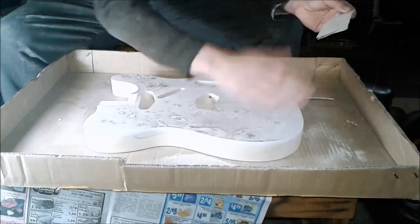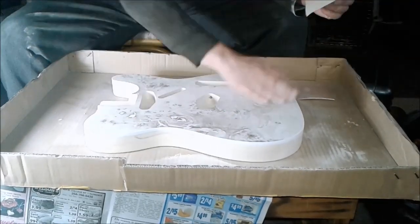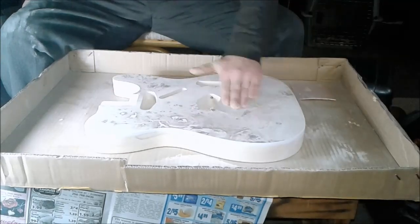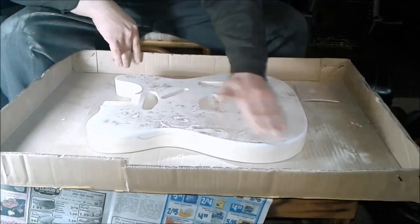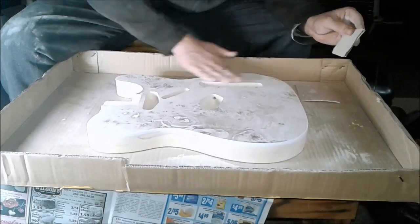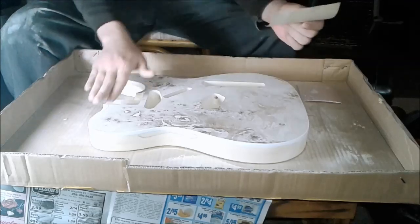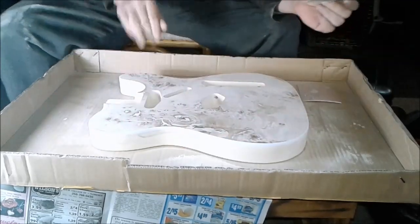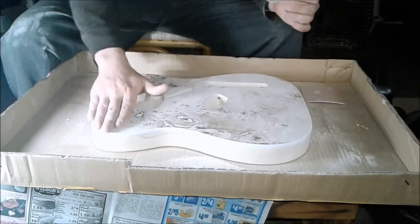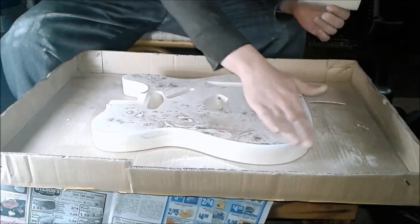Make sure you wipe this plastic filler dust away. It will scratch the top. Now, 120. And I will say I was making an emphasis to go around the edges quite a bit more than I am in the center here. Not only because it's going to be covered up with a faceplate and a thing here. It's because I want to ever so slightly arch this top. If this didn't have binding on it, I would be arching it a lot.